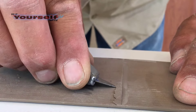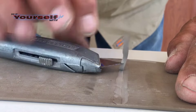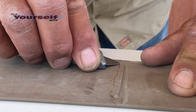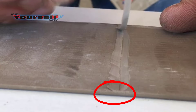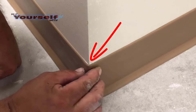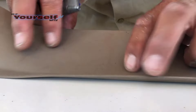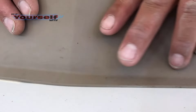You may want to practice on a piece of base just to get the hang of it. This doesn't have to be perfect and it doesn't have to look good — you're just taking out enough material so it'll make the bend around the corner. At the top of the base I didn't make my cut all the way through, so I won't see the cut when I wrap it around the corner. I also didn't cut the shoe or the bottom of the base, because it's going to stretch around the corner and lay flat on the floor. If you were to make that cut through that area it would just rip when you wrapped around the corner.